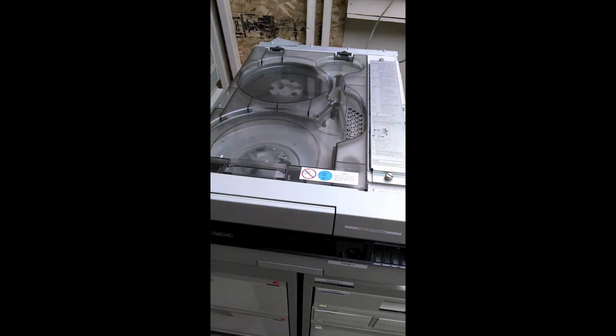And the other big difference between it and earlier models like the 7974 or 78 was that it's a streaming tape drive. Earlier tape drives, when they would read or write the tape, would start the tape moving, do the operation, and then the tape would stop after a moment.